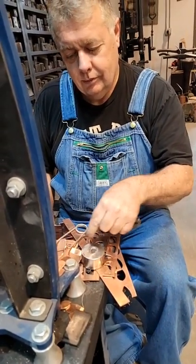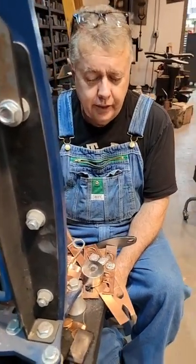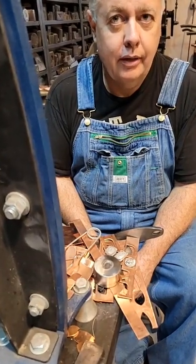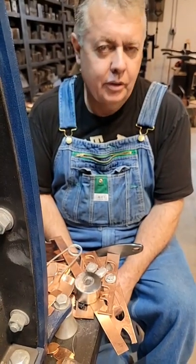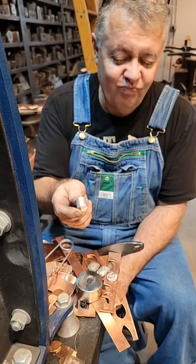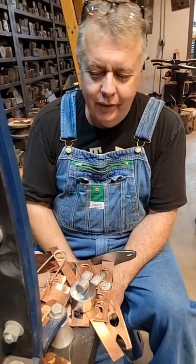So, Jessica, the video has been about how to make a force for impression dies to be able to get better impressions, better detail. Feel free to use copper, like buy a copper rod, or an aluminum rod. Brass kind of sucks, it's just going to crack. I would stick with copper or aluminum. They both work well and they're cheap. I just happen to have aluminum. Had I had copper, I would have used it. I even agonized a little about it because they're all going to think you have to have aluminum and ask me about the grade, when the reality is it doesn't matter.